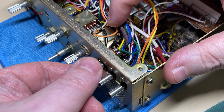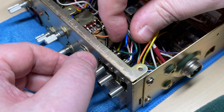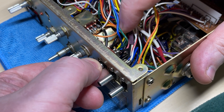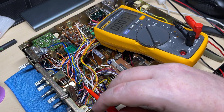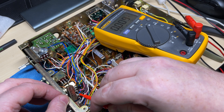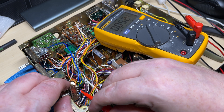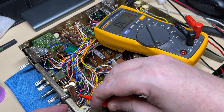We're going to be moving the RF gain to the high/mid/low switch, so we need to disassemble the high/mid/low band switch. Now this switch has got two functions: it switches the crystals, and it also changes the display to 41–80 and brings on the highlight, so we need to try and preserve these functions.